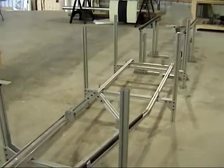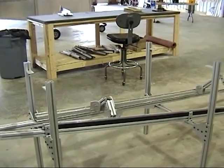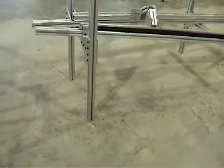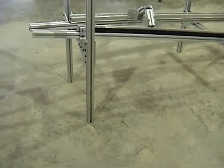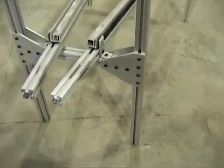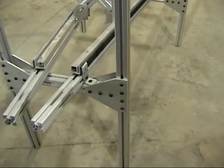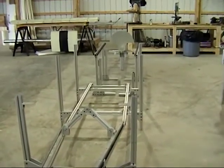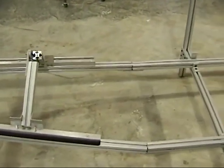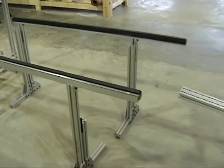This originally was going to do the turtle deck skin — we can still attempt it that way. Basically the way we wanted to do it worked out really well; we could actually do it in this fixture the same way using those arms as our clamping points. If we do that, there needs to be a bar across the bottom to hold the pressure of the clamp — one that is the same distance as that bar right there. So it makes like an H, and then you just set that in. It'll work out really nice. All these pieces fit nice and neatly right inside of it.